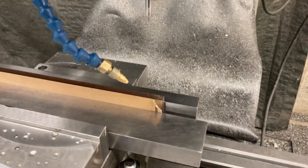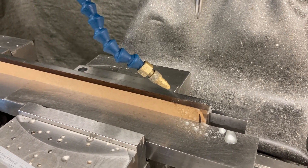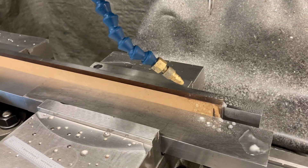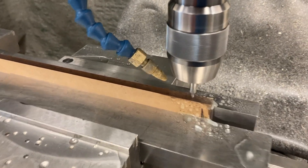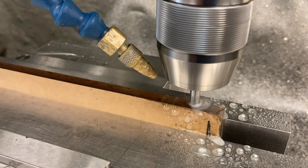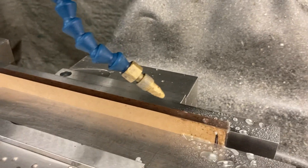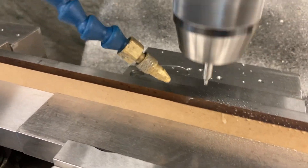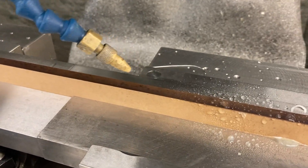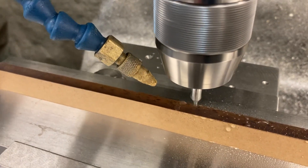I'll show you me drilling some holes here. Center drills — no big deal. I center drill the hole with a number three center drill, 250 body. I'm doing 10-24 holes, so I drill deep enough to have enough chamfer on top with the lead of the center drill so I don't have to go back and do anything later — about 235 to 236 deep. I got the spray mist on, makes for a cleaner looking hole. Plastic heats up and gets cloudy, so coolant helps. It's pretty neat when you peel the plastic off after and you can see the threads inside because the hole didn't cloud up from heat.